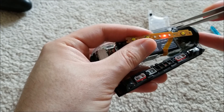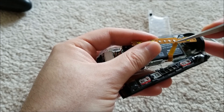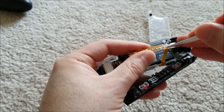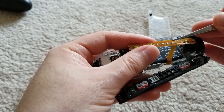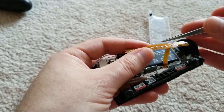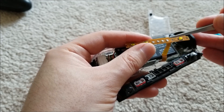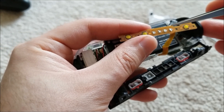So what you want to do with your soldering iron is there are two points on each LED. You can heat them up and then using a thin, tiny pair of tweezers, you can just slide them off the pads. Now you don't want to heat up the pads too long because you'll actually risk lifting them. All this material is just a very thin, flexible, mylar-type material, so you can actually burn it. So you just want to be really careful with that.